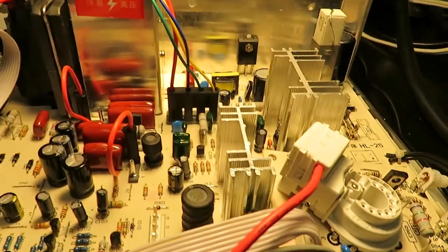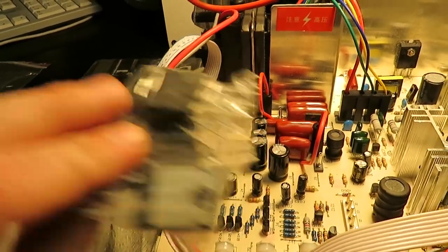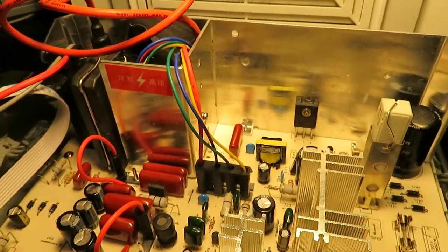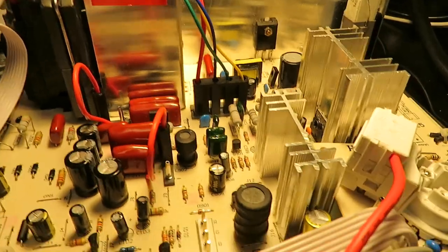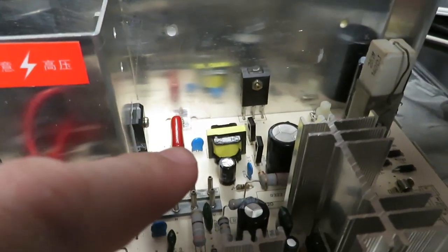This is now a couple of weeks later — I've got a bunch of new transistors. Here's the HOT and here's the driver transistor we're replacing. I also got some bigger hefty ones and other transistors too. The idea is I'll first put in exact replacements to get a baseline of what's happening, and then we'll try the other ones with some measurements to guide us where we need to go.